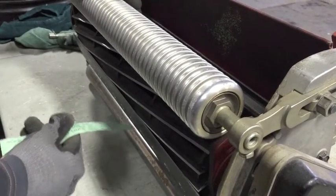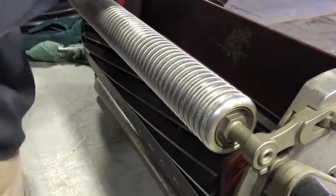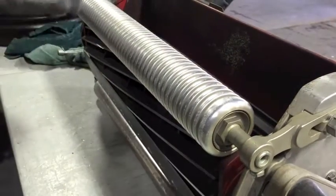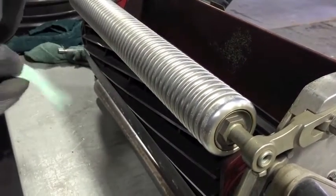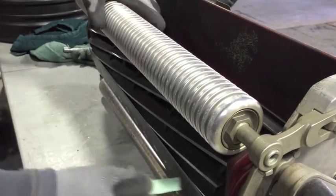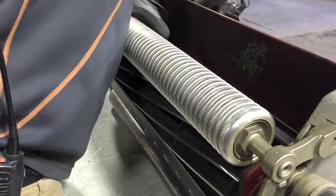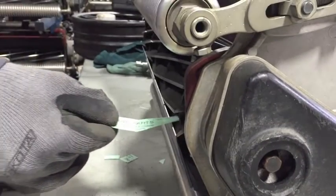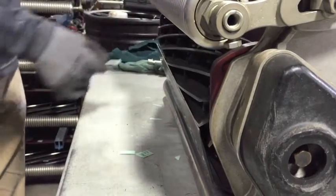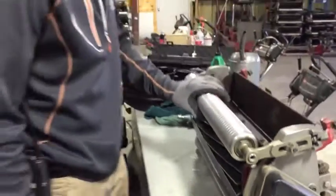Tightening just enough to start to hear a little bit of contact, then we'll ease it back. It cuts there, cuts there, cuts there. We can still hear a little contact so we can ease it back a bit — we want the least amount of contact as possible, but it still cuts. That side's not quite as well, so we adjust. Now we can hear a nice cut across the whole reel — nice, clean cut on the paper. I think we're good to go.